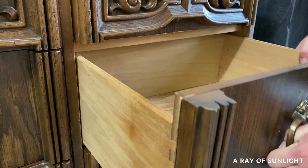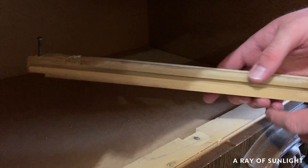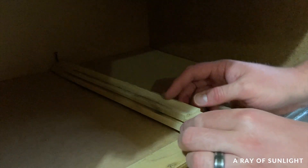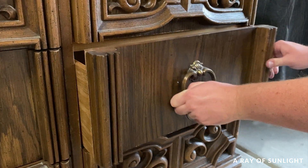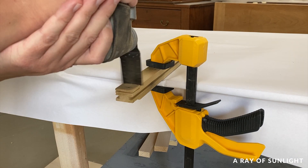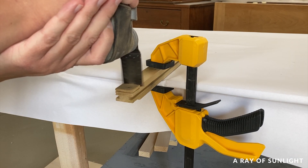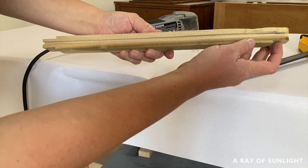One drawer was a little bit wobbly. The front of that drawer track was worn out, so we tried to just flip it around and screw it back in. The track sat up way too high, though, so the drawer couldn't go in all of the way. So I cut a notch out of what was now the bottom front of the track so it would sit down like the other end had before. That was the ticket — now it works great again.